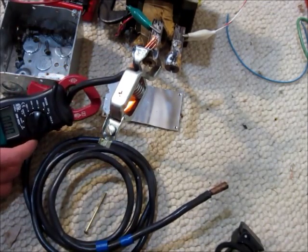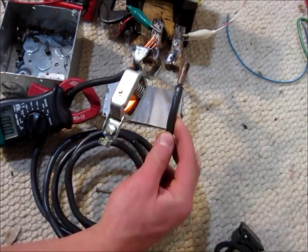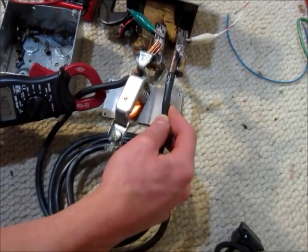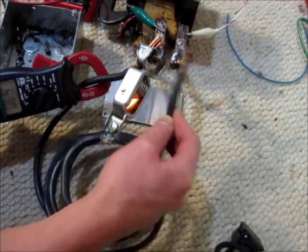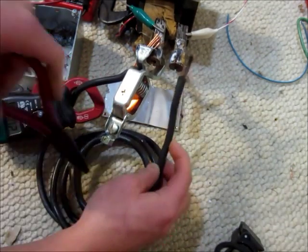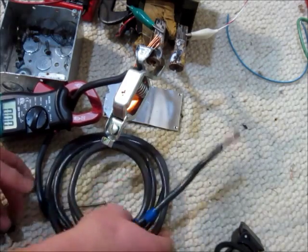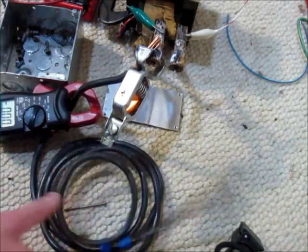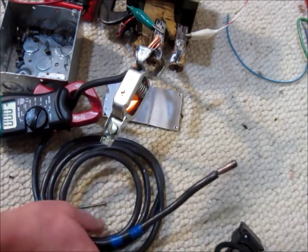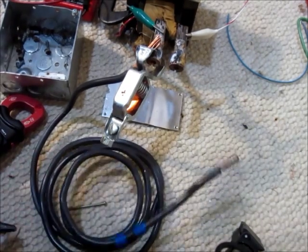I've got the amp meter on here too. You can see there's a screw in there that jumps around from the magnetic field. We've got 590 amps there. That screw really sticks to stuff in there — it's pretty strong. It's already really toasty, pretty hot. It's starting to smoke a little bit at the ends. It heats up really fast — almost 600 amps of current going through that wire. Not quite what it's designed for. Ouch, it's really hot — it's getting squishy.